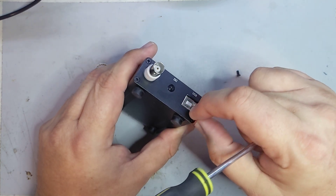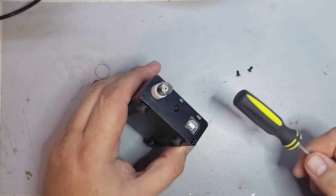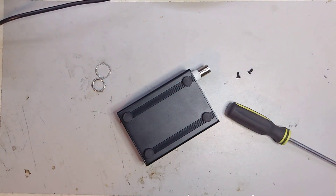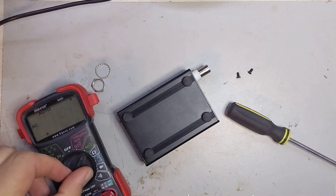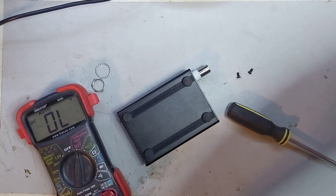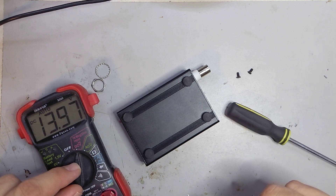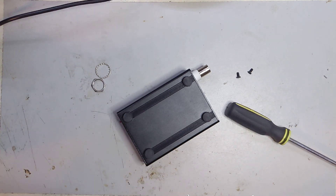The QDX is a wonderful radio, and sometimes even wonderful radios can just go poof one day. Who's to say it's the QDX's fault? Who's to say that my bench power supply isn't to blame? Let's see what it's running at. I think it's running at 14-something volts and this thing is rated for 12. Let me grab the voltmeter and check the voltage. It's almost exactly 14 volts — that's definitely higher than the 12 volts it's rated for, by about 20%. Okay, could that be it? Yeah, could be.